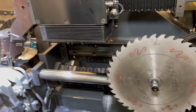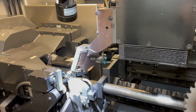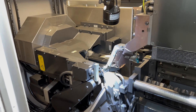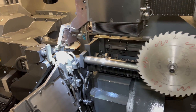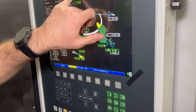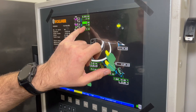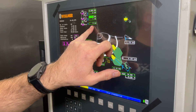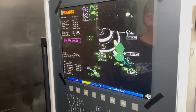Here's the saw blade, and this is clearly not a garden-variety sharpening system. The plan is two passes of 0.050 millimeter, one pass of 0.025 millimeter, and then three spark-out passes to give it a nice, polished shine.